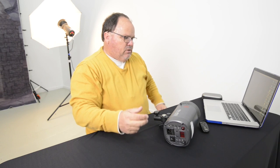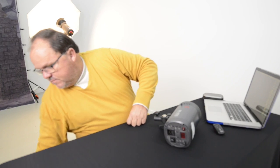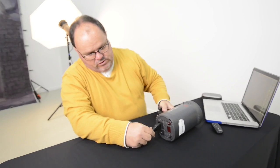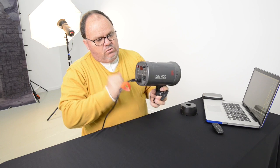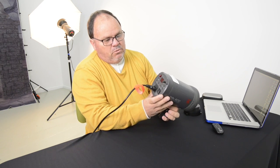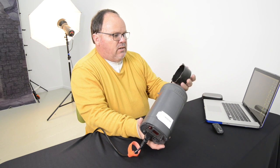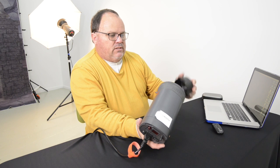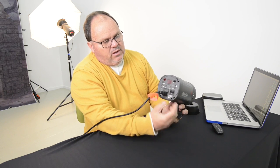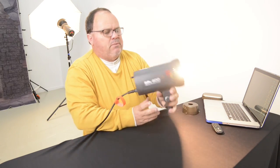Let's put some power on so we can see the back here. I'm going to pull off the front protective cover. I've seen many people and quite a few students melt them to the actual heads — not with these particular brands of light, but I've worked with the Bowens quite a lot and a lot of students forget that if these plastic covers are attached to the front when you put the power on, they can overheat and melt, attaching to the modelling lamp or flash tube which requires you to get a new one. Okay, power's attached, mains power's on, and you can see the modelling lamp firing away there.